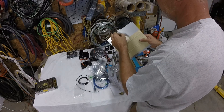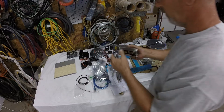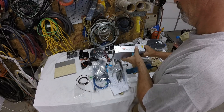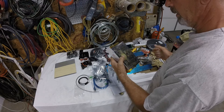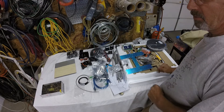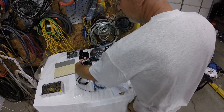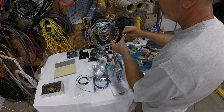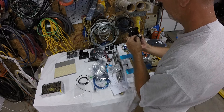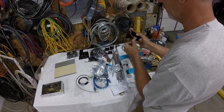We're getting rid of that - I got plenty of blue tape right here. Here's the power supply: 12 volt, 20 amp. I already ordered MOSFETs for the heated bed - I actually ordered two: one for the heated bed and one for the nozzle heater.